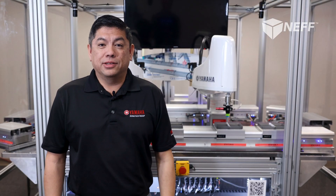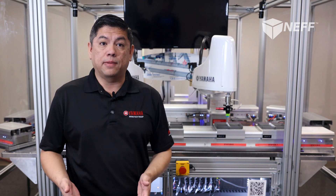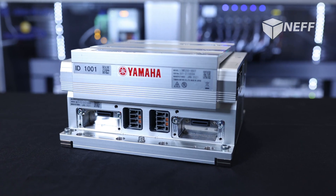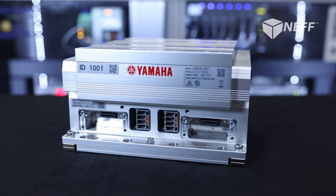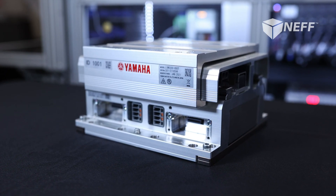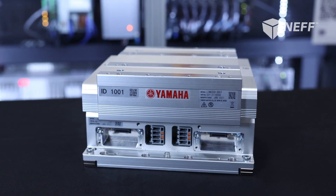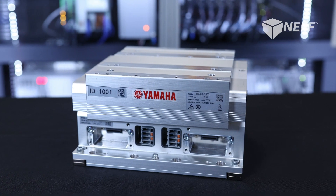This is probably the number one question we get asked. The servo pallets move around the system via magnetism. The LCM is basically a flat motor with the magnets mounted on the pallet and the stator coils of the motor are powered on a fixed module by 48 volts DC. Multiple pallets and modules make up the simple construction of an LCM conveyor. Mechanical engineers can literally lego the conveyor system together. Modules are available in different fixed lengths: 200, 300, 500, or 1 meter long.